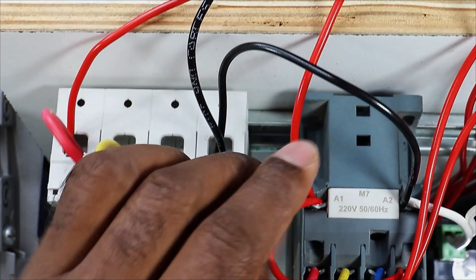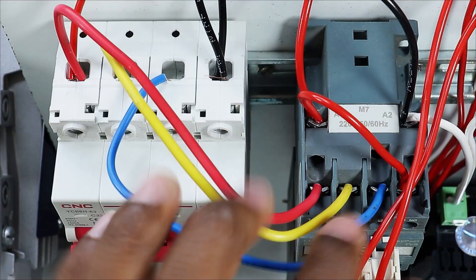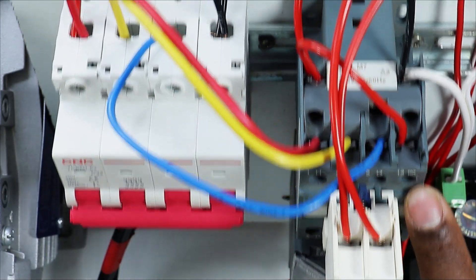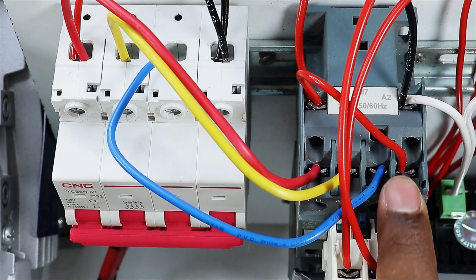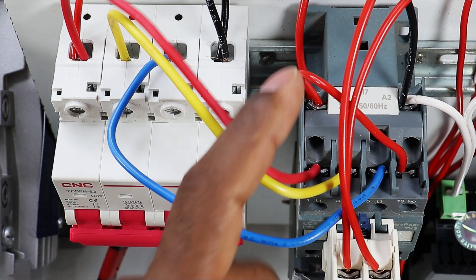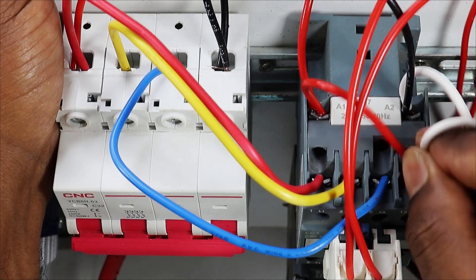In this condition, what we can do is — this wire here, from where this wire is looped, as you can see this is the NO contact. This wire is connected to this NO contact; that is, with this wire of the holding circuit we can connect this wire. The power supply will come in this wire only when our contactor starts. So with this NO contact I am connecting this wire.